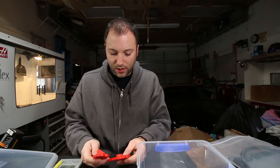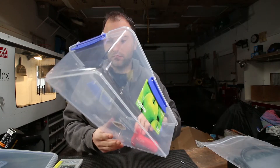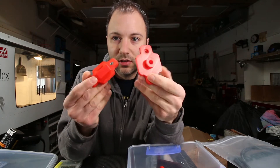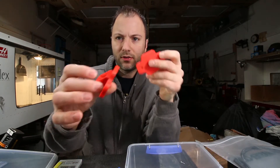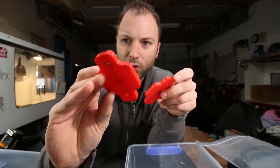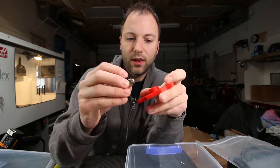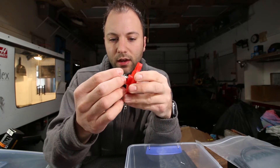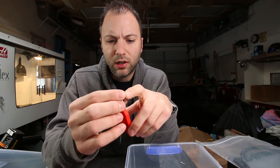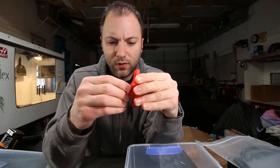Next, we need a way to get the filament out of this and get it to the printer. There's a very nice model I found on Thingiverse — basically a little pass-through. On one side it's got a simple little filament guide with some holes and a nice surface for a gasket almost. The other side has a hole that looks like it's designed for — and there are links on the Thingiverse page for this — a little O-ring and a push-to-connect fitting, typically used for airlines and things. So this seals up very well at even very high pressures.